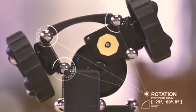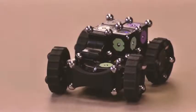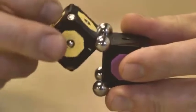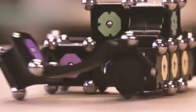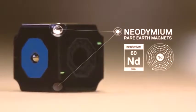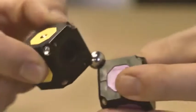One of the coolest parts of MOSS is the connection system with these little steel spheres. There are tiny magnets in the corners of each module, and by snapping them together you can create all sorts of joints. With one sphere you get a universal joint, with two you get a hinge, and with three or four a rigid connection. The properties of these little fiddly bits let you build some pretty cool kinematic constructions. The neodymium rare earth magnets are over-molded directly into the plastic during the injection molding process, so they won't ever break out and cause a problem.